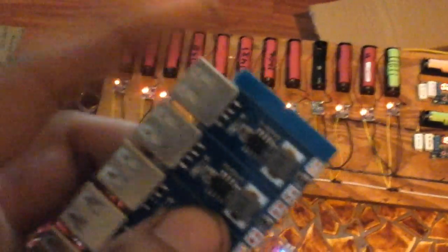So I ruined all those by neglecting to discharge and get its capacity. This right here is just a small little portable charger that I had made to charge our tablets and whatnot. This is a 2 amp charger, and what it does is it's a boost converter to boost anything from 2.5 to 3 volts up to a USB 2 amp charger.